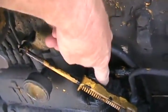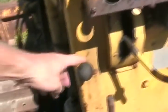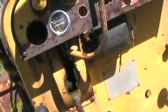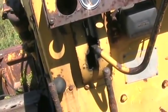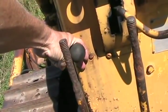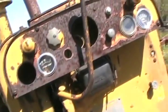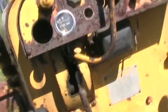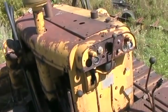There's also a little place to prime the injector pump. This is actually one of the easier machines to prime when run dry on diesel — a lot easier than a car. When it's started up and running on gas, you put it back to diesel compression and keep lifting the diesel throttle lever. The motor still has RPMs and as it winds down toward stall, it starts to purge the pump and push some fuel into it. Just before the engine stalls, you pull back out, lower the compression, and it starts running on gas again. Then lift the diesel lever again and purge the injector system a little more. Only two or three tries and it's fully purged and fires up on diesel even after being completely run dry — all while running on gas, no battery cranking needed.